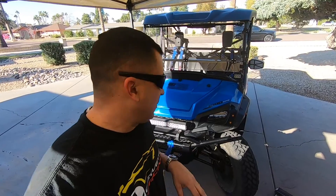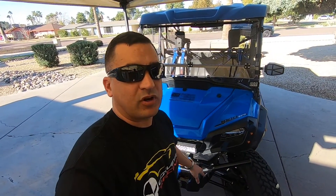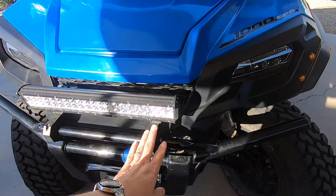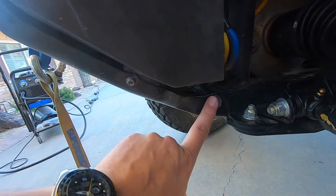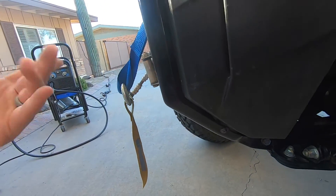The first thing I'm going to do for video purposes and to let my viewers see in there a little bit easier is I'm going to move the stock bumper. It's really easy to do if you haven't done it. If you've installed the winch you've probably already done it. I'm going to take the light off because it's wired in. Those two bolts we're going to bolt to are right here. There's one bolt there and one bolt there on the other side. So it's essentially eight bolts to get it out plus a couple more for the light. I'm going to remove that just to show why I chose this position to do these braces.